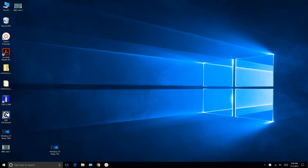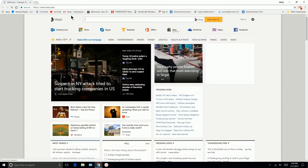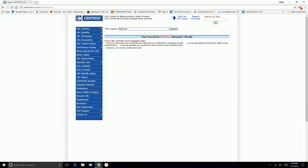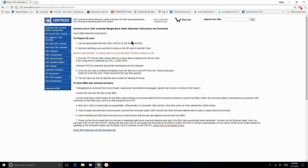There is a button right here in the corner, opposite the SD card slot — it says 'User'. That's the button we're going to need. The first thing I'm going to do is insert my SD card reader into the PC. Okay, it popped right up — it's USB Drive D. I can see there's nothing on that card, so note that it's Drive D. Let's close that and go to Centroid's website to get the files and software we need.